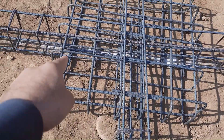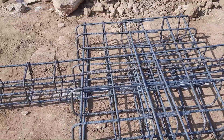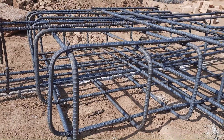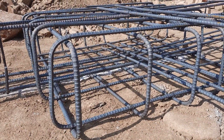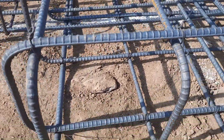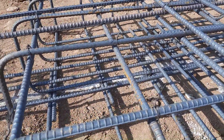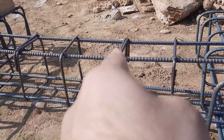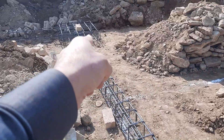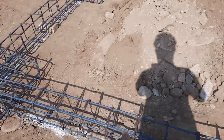You can see the size of this footing is 4 by 4 feet. You can see its steel reinforcement — the depth of this bed is 9 inches, but with concrete cover it will be 12 inches. We have 12mm steel diameter with a spacing of 6 by 6 inches. All these footings are connected by an RCC beam which size is 9 by 12 inches.